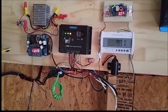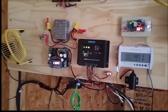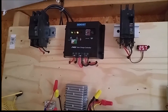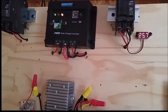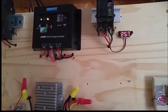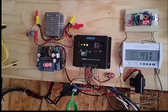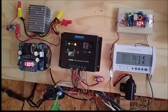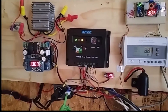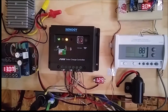What I want to show you right now is charging my lawnmower's battery using my solar charge controller. That's my primary charge controller right there, and that's my 24 volt system — sitting at 25.7 volts. This is my secondary charge controller right here, and this is my 12 volt system. Currently my lawnmower's battery is sitting at 12.9 volts, and the charge controller is telling us that the lawnmower's battery is fully charged.